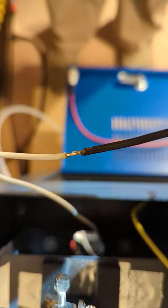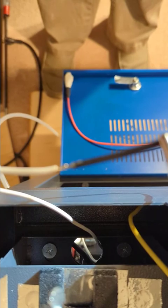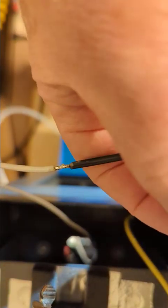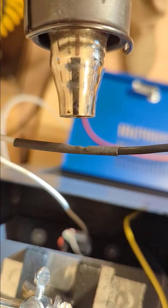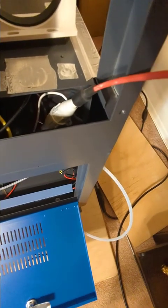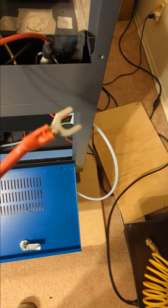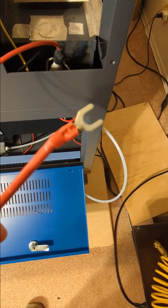Here I'm soldering the milliamp wire that comes back from the tube to the power supply — just held together in alligator clips and then soldered. I had previously put shrink-wrap tubing on one of the lines, so I'll slide that over and shrink-wrap it. I've also cut the high-voltage wire to length and crimped on a connector for the bulb, and I'll do the same on the other side.